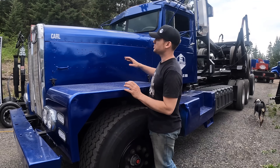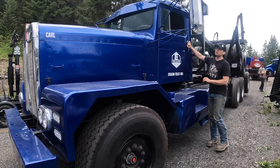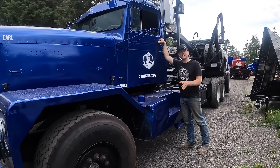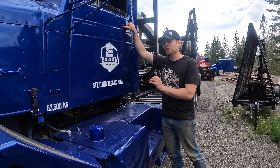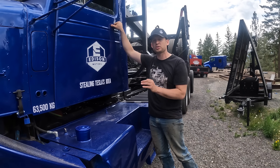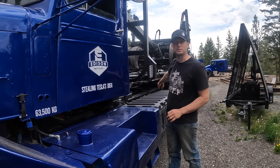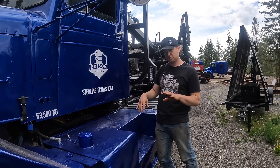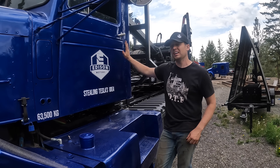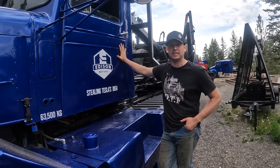The engine works great and the generator works fine. Soundproofing in the cab was not adequate in 1962, and you wouldn't think that would be a big deal — we didn't — but it was actually more comfortable to drive with the sound when this truck was a mechanical diesel. Because it makes no noise when moving, you hear every single little thing: leveling valves, airbags on the back end when you hit bumps. Any rattle or squeak is so noticeable. So we're going to increase our soundproofing, something I did not think would have to be done on an electric truck.